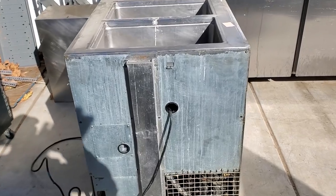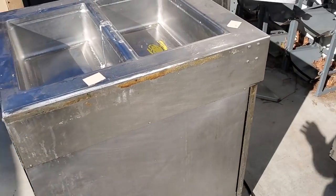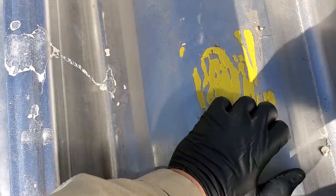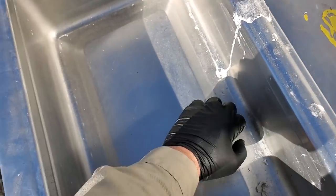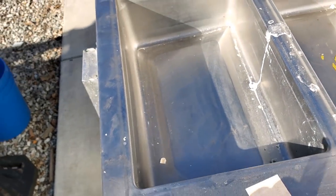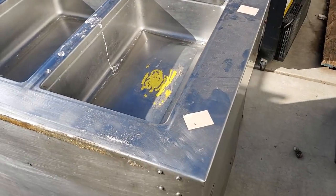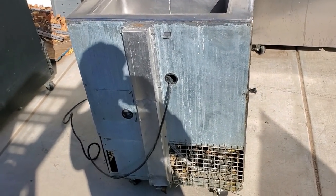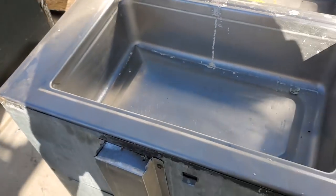I'm back at my shop now and I'm going to figure out what happened with this box. We got a new box — they replaced it — but I want to know what caused these things to swell up and pop. They're completely pushed up. It has a refrigerant leak in the cold rail. I'm going to do some investigation and pull the back of the box apart. We're going to start by draining the glycol out. I originally thought there was no glycol left, but there's fluid in there.